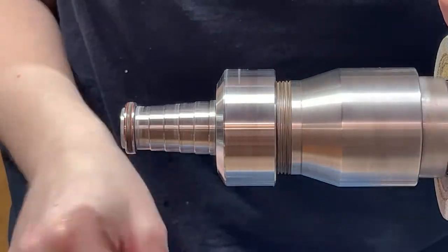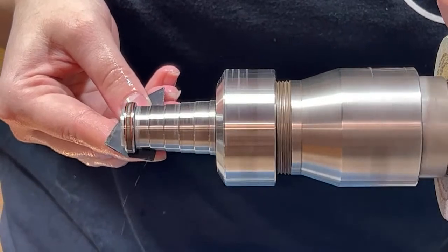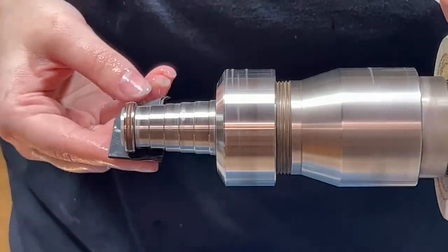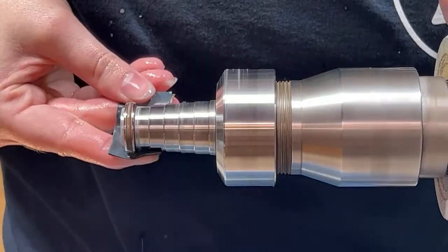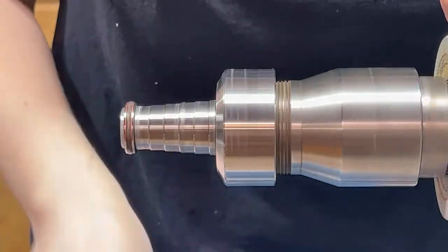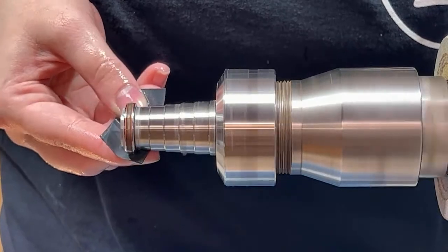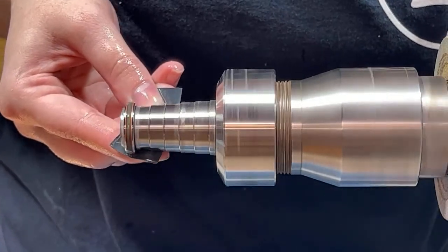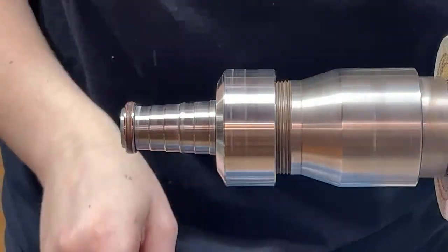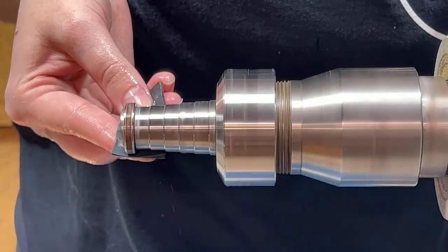As far as speed goes, I'm going pretty fast right now, but when we get into the polishing I will turn it down. You're going to want somewhere between 700 and 900 RPM. I'm going a little faster than that right now just to get some of this material off as quick as I can, but 700 to 900 is definitely your sweet spot for sanding and polishing rings.